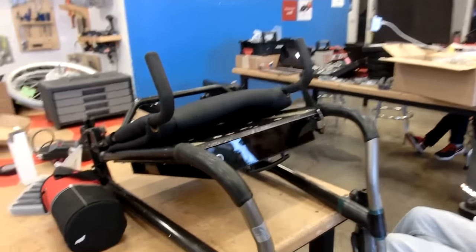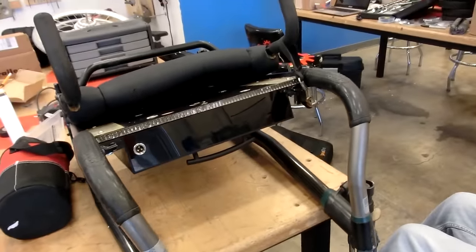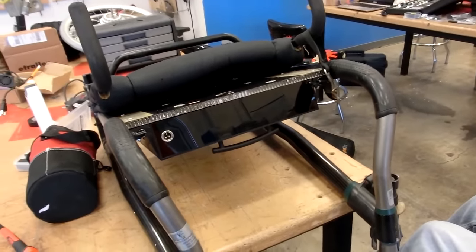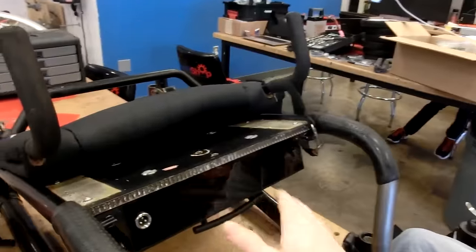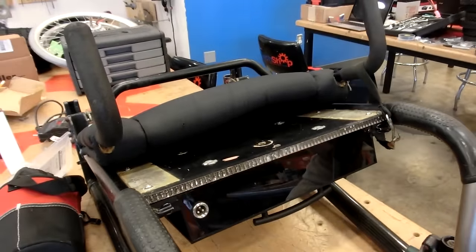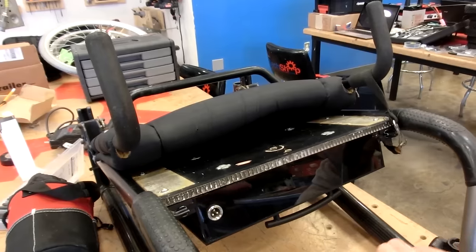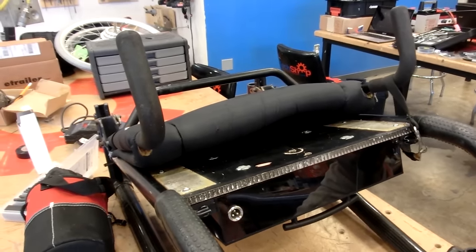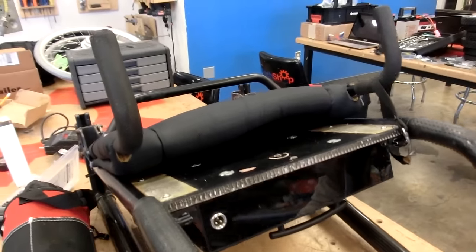And it probably has twice the power of your lead acid ones. Big old lead acid. There's two lead acid in here. Actually, then again, that'd be 100 amp hours, because they're just like RV truck batteries, right? Yeah, big ones. So that'd be 100 amp hours times 12 volts. So that'd be, well, 1200. Oh, never mind. So this is probably a quarter of that. Never mind. But still, it's like 1/20th the weight.